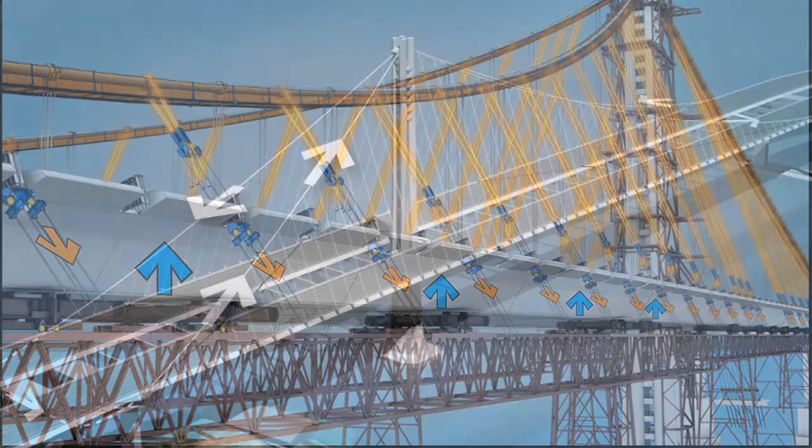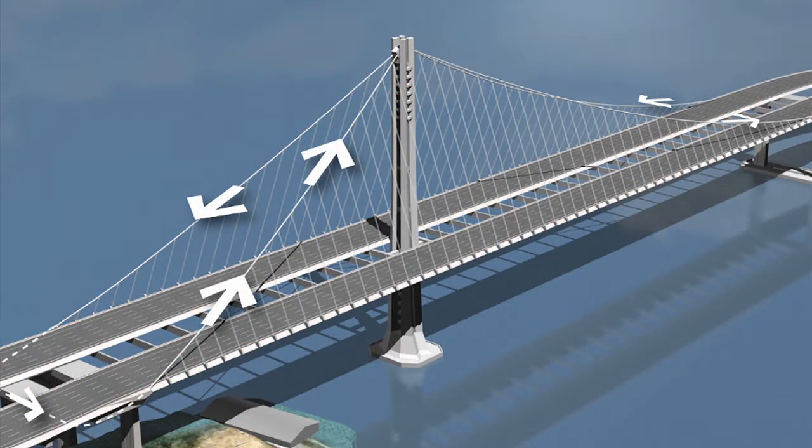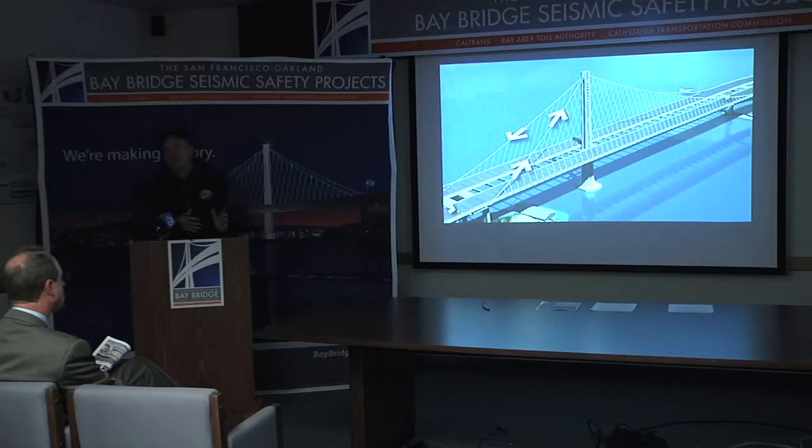But what is a self-anchored suspension bridge? Here's a graphic that helps out a little bit. Ours is unique — we're building the world's largest self-anchored suspension bridge, and the only one with one central tower and only one main cable. Instead of having two — or some people even think there's four out there — this main cable anchors on the eastern side of the bridge, goes up to the top across traffic, crosses traffic again as it loops right around the back end, then continues over traffic up to the top of the tower and anchors on the eastern side.